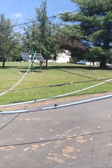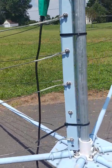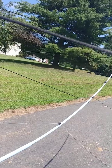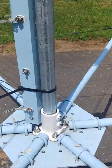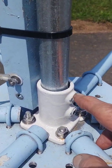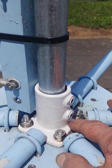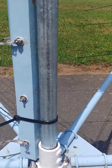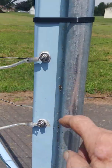Right now it'll turn around pretty easily. You can see the mast if I can get through all these wires. The idea is to be able to take the hex beam down and work on it without having it be 11 feet off the ground, because the distance from the center to the end of the fiberglass supports is about 11 feet. Here's a close-up of the mast — there are two of these, one above and one below. These are steel, not aluminum like the original K4KIO hex beam. I drilled a hole in the center of the plate and mounted these two on here using the similar holes that were already there. I took the center support and anchored it using UV-proof Gorilla zip ties.